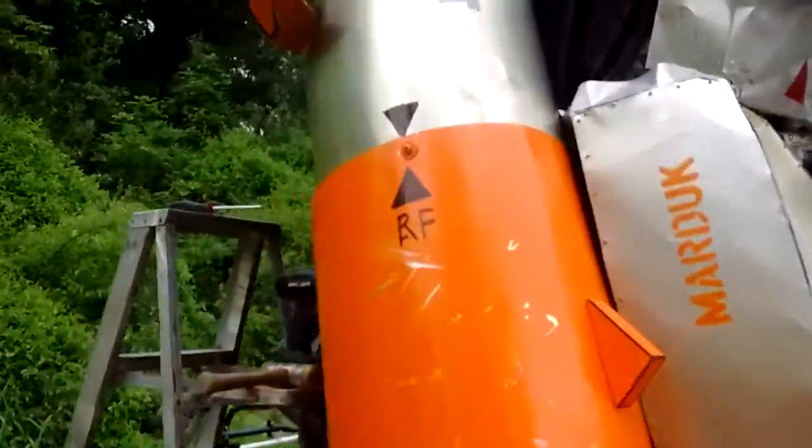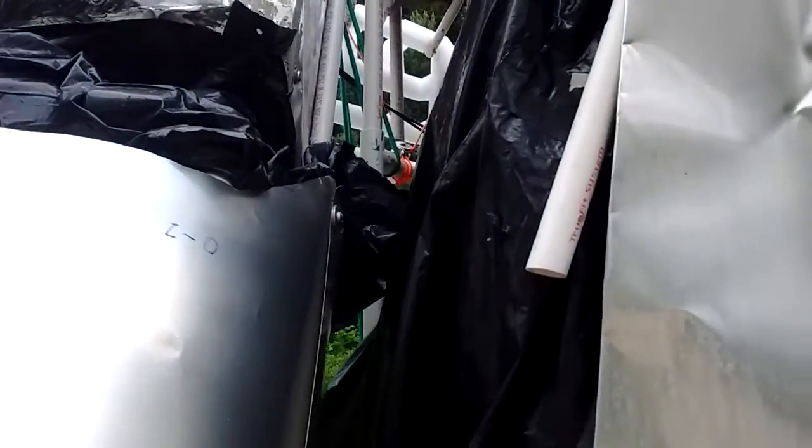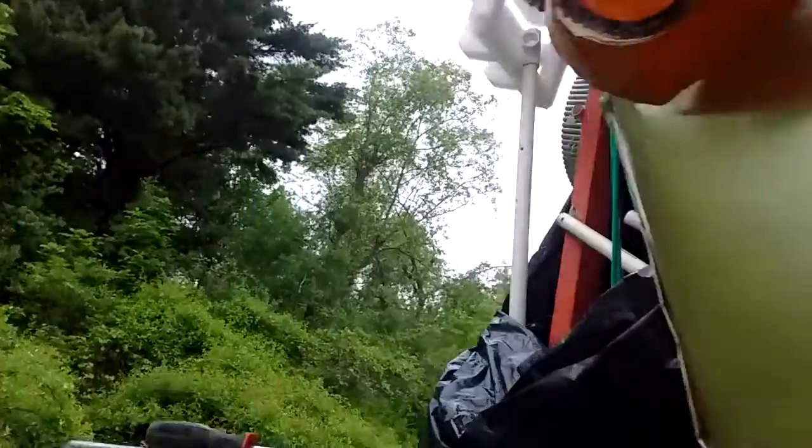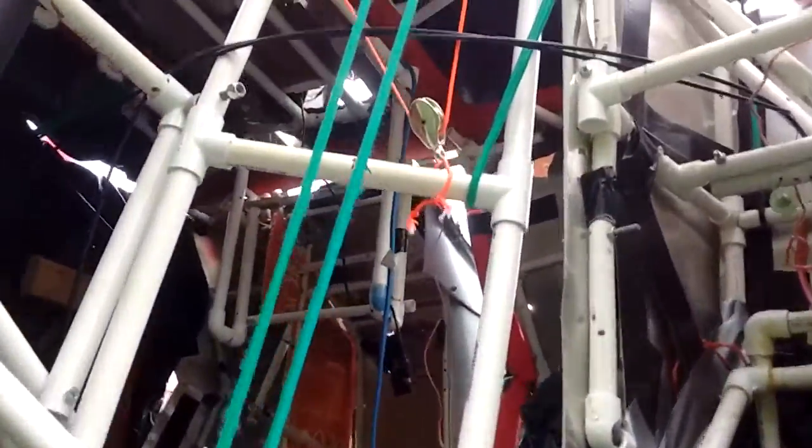And this shoulder mechanism is working out okay. I mean, there's some clearance issues with the forearm and the body, but I think a little spacer up in there might be able to fix that a treat. But the only real issue I'm having is because I'm using PVC, you can see this lever point bends a lot, so I'm not really getting as much shoulder swingy forward motion as I would like out of this mechanism.